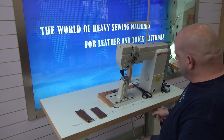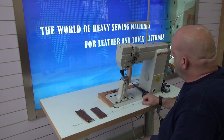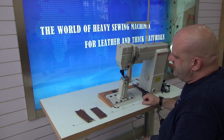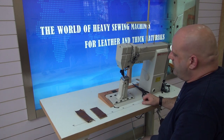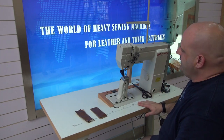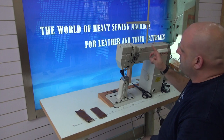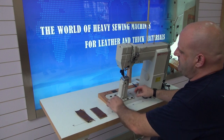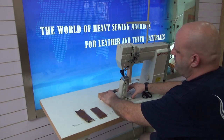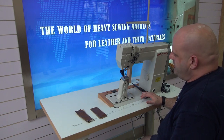The machine is coupled to our HPP70 servo motor. In this particular case we are not running a speed reducer because the HPP70 is an extremely powerful motor, which means that we don't have to run a speed reducer unit to gain extra power. This machine features fully adjustable stitch length, fully adjustable thread tensions, and you can also adjust the post on this machine by virtue of these screws here. You can move the post to the left or the right depending upon the projects that you're doing.